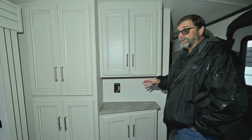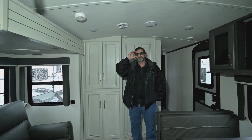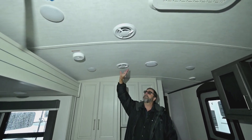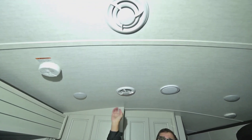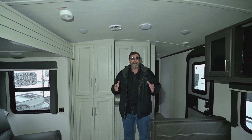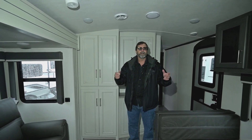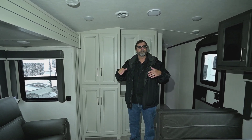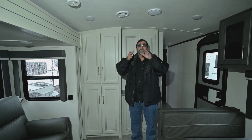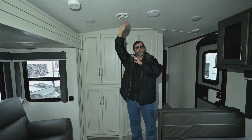That is a really cool element in this coach. If we look up, Keystone has developed their own patented air conditioning system. One of the things I really love about this is that the air comes out dispersed — it doesn't just blow one direction wherever you point it. You get a lot more distribution of air, it doesn't just blow down your neck in one place, and that creates a better air conditioning system because there's less back pressure. The ducts get smaller as they go up to the vents, so we get good output. They also have a nice advanced filtration system in their air conditioner.